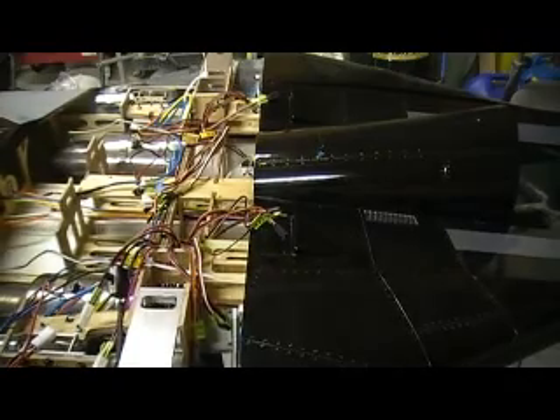I had a couple questions about these turbines being that close to that wood. No, it's fine — that's all that's needed. This part won't get too hot. It gets warm but not enough to catch wood on fire. Also someone was saying about air going around these engines. Remember there's a gap between my exhaust tube and this engine — it's going to be about that wide. Any time air blows across an open area it creates a vacuum, so it actually will suck air around that turbine and keep it cool. My F-16's front duct is half that size and I've got that turbine almost right up against it — I don't have any heat issues with that P-200.